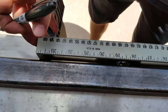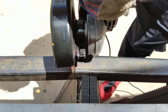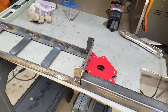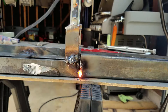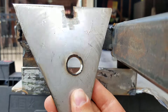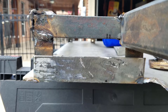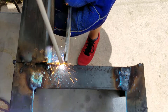Next, I wanted to mount the square tube that would hold the wheel. I measured just how long the square tube needed to be and cut it. I cleaned up the corners of the chassis to ensure a good weld and used my fancy welding magnet to hold the tube perfectly perpendicular while I tack welded it. I then drilled a hole to fit the wheel's axle. The motor mount is made of stainless steel and because it's not magnetic, I can't use that bracket I was using earlier. I marked two vertical points on the back of the chassis to align the motor mount and welded it on.